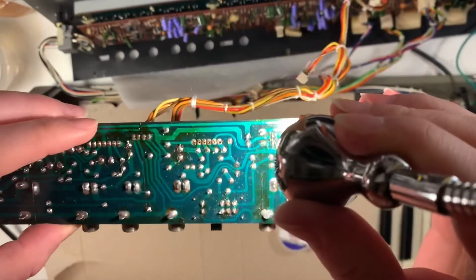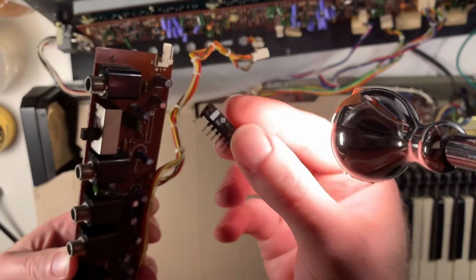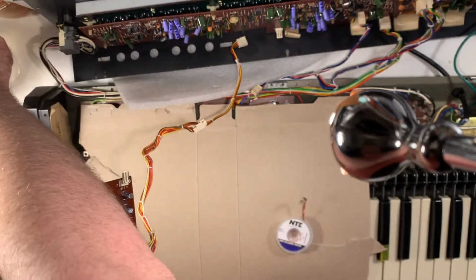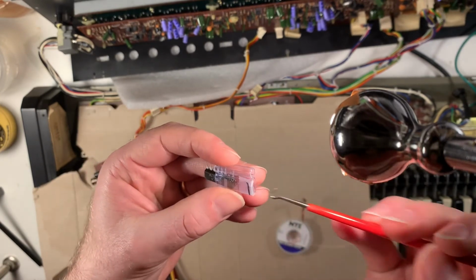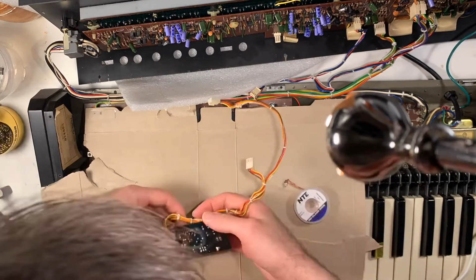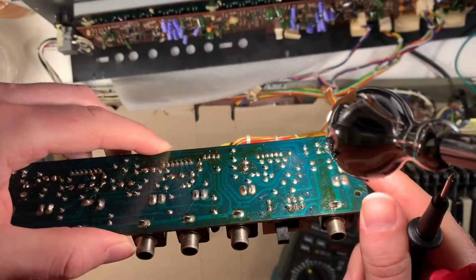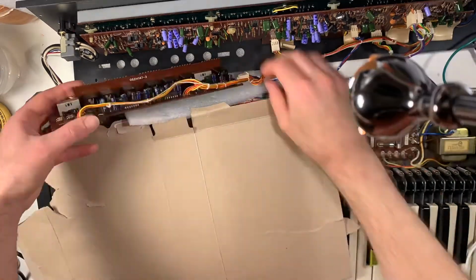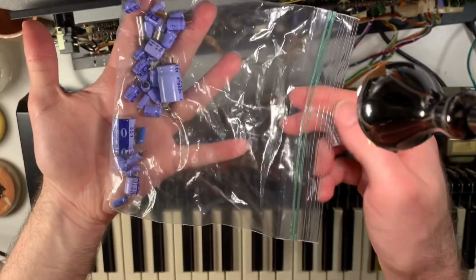Okay, the moment of truth. I have the test probes from pin 3 to pin 8. That's plate to cathode. Here's the old one. With the isolation transformer providing the current, I'm going to set the voltage to only 162 volts DC. Alright, plugged in the amplifier, through the current limiter, which keeps Jack very entertained, and for that, we're appreciative. Alright, so I've changed out the chip.